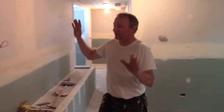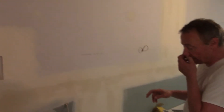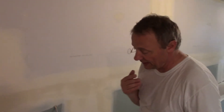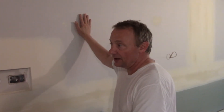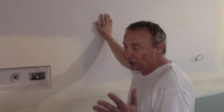I was talking to you about hanging drywall, the reason we glue it, and how I use very few screws. Just this morning in some research I was talking to a representative who manufactures drywall, mud, and everything else. The question was: can gluing drywall create screw pops?